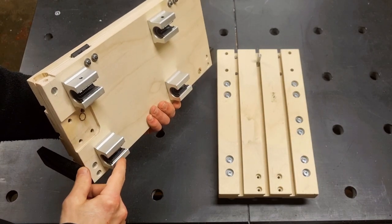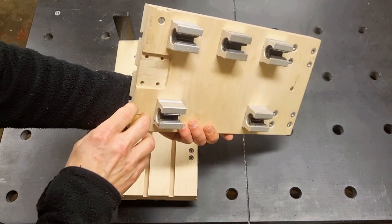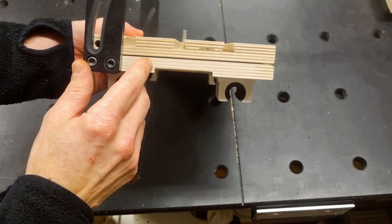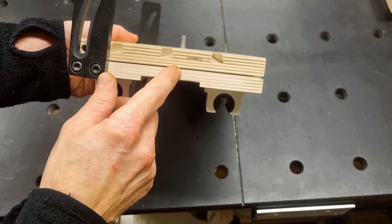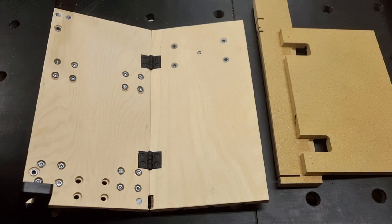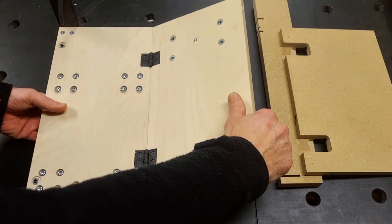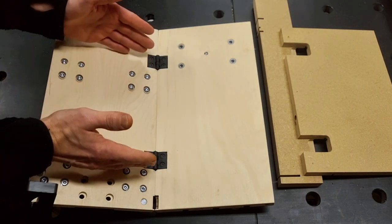I will now give you some more info on how I built it. I had four linear bearings lying around in the shop making no use, so I could afford to make a new carriage and try this concept — I still have my old carriage in one piece if I want to go back. The inner part is 15mm and the outer part is 18mm. I use dovetail clamp tracks because they occupy the least amount of height. I don't want the outer part too flexy but also don't want to make it too thick and add weight outwards. The inner and outer parts are connected through zero free-play hinges — they're made of plastic but have absolutely no free play, which is really important because you don't want any flex in this open-book construction. These hinges were routed in using a routing template to make sure they ended up exactly at the same place and same distance in both parts.